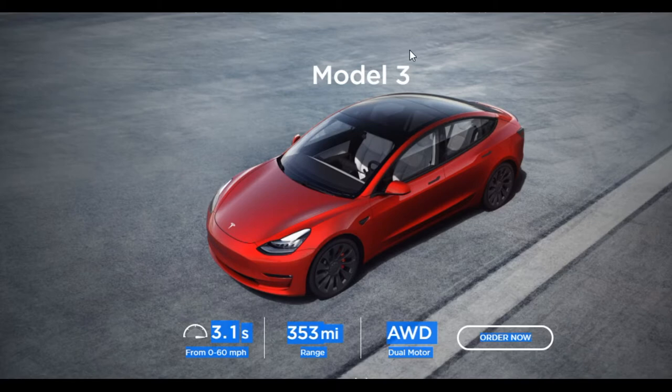All right, so this is my Tesla Model 3, and we'll go on with the 240 volts. Now, the 240 we're adding is a number 6 wire, so it can handle up to 48 amps, no problem. So it'd be no problem charging. Don't go with your dryer wiring, because those only have 40 amp capability, so they're not big enough to handle the full power of charging. So make sure that you do a 240 with number 6 wire. If you go bigger than that, yeah, okay.